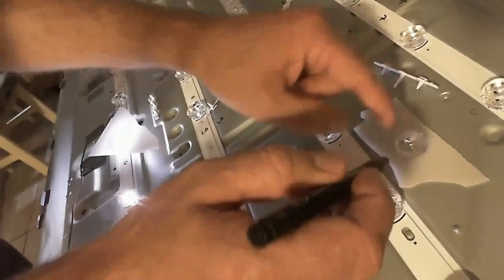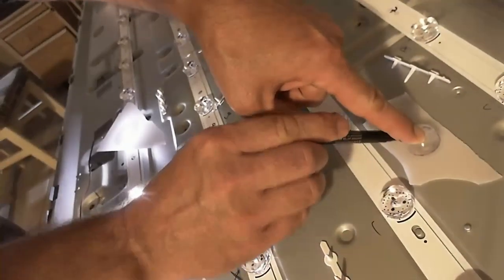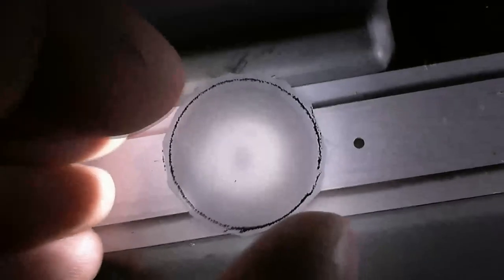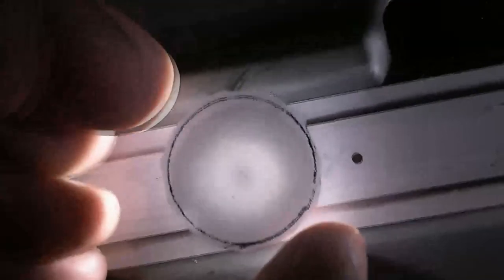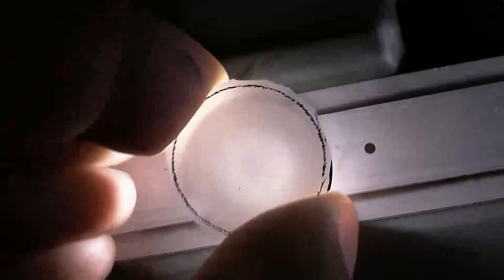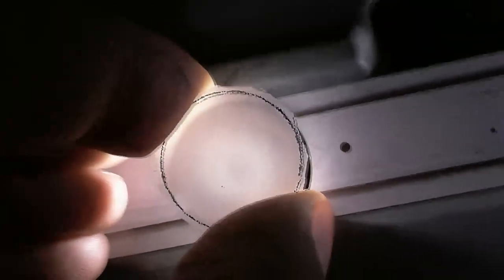The next thing would be to exactly adjust the little lens into the right position. What I'm gonna do here is cut out of an old piece of diffuser — maybe you could take some thick white paper too for that. This one here is the one I just cut out, and we can now see if I move it around. I move the diffuser sheet with the little lens underneath, and this way you are able to put it in exactly the right position, hold it there, and glue it in the right place.